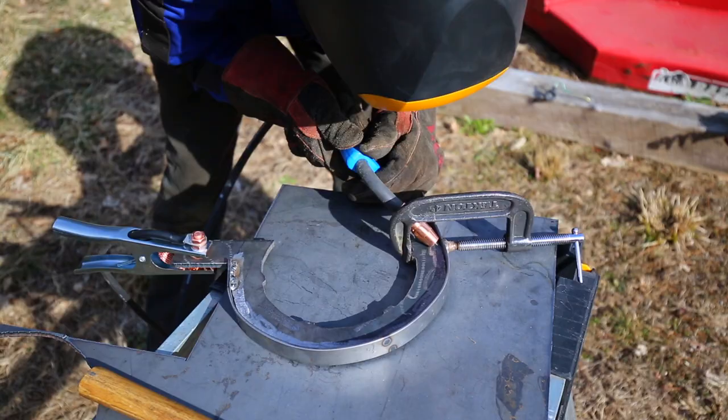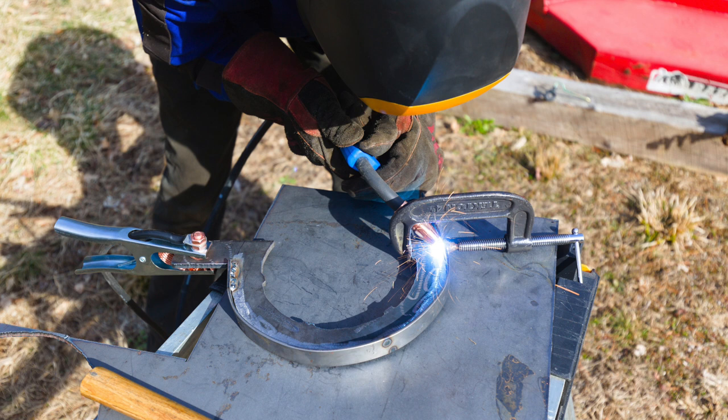Alright, so after I finished filming for the day, I figured out why my camera kept stopping recording while filming welding and plasma cutting. I use a Canon DSLR as my main video camera, and it has an infrared sensor on the front of it, which is intended for use with a remote control. Well, as it turns out, welding arcs put out infrared light, which kept tricking the camera's sensor into thinking that it was being triggered by a remote control. As a result, it kept taking pictures like the one that's on screen now. In the future, I'll cover up the sensor, but for now, some of my welding shots will be interrupted.